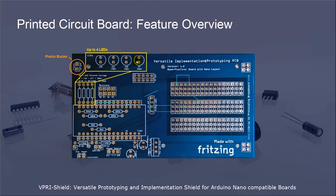The Arduino pins D5 to D8 are connected to button pins. You can solder the wires of any button of your device to these pins. For each button, there is a location to mount a pull-down resistor. Next, you have five pairs of 5-volt and ground pins which you can use to supply any element in your device with 5-volt power.